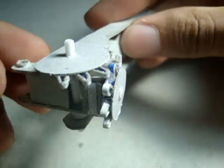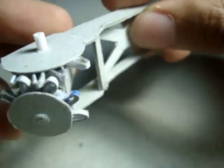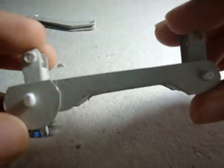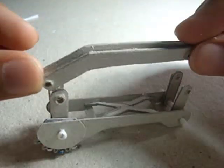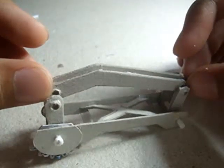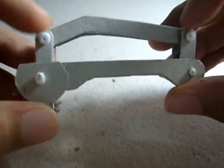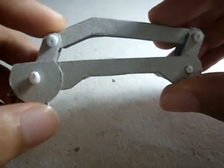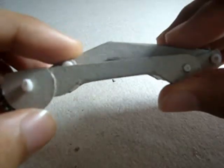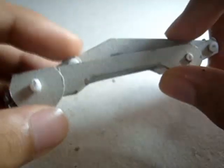Creating this corner with all the gears was the trickiest part. From here on, it's fairly straightforward. We'll attach the remaining two pieces on the other side like this, and then we'll make one more arm that's bent like this. You're probably wondering — doesn't that affect the parallelogram? Well, no, not in its functionality, because the holes still are 60mm apart. Being bent allows it to work around an obstacle which it would have otherwise encountered if it were straight.